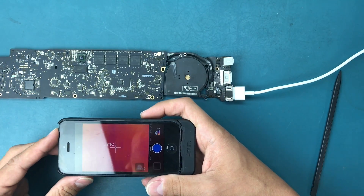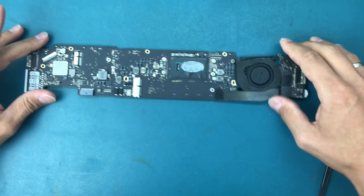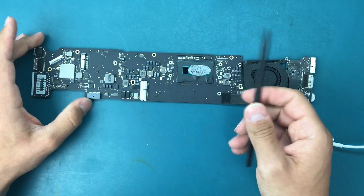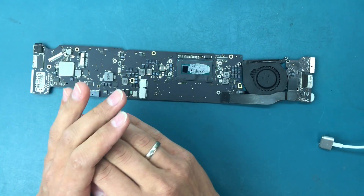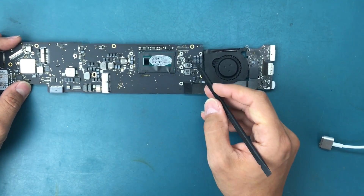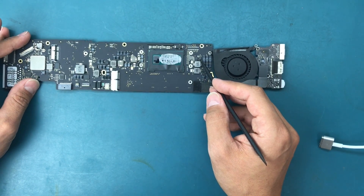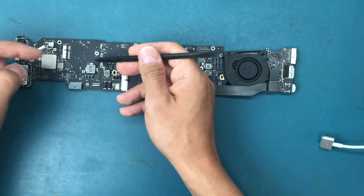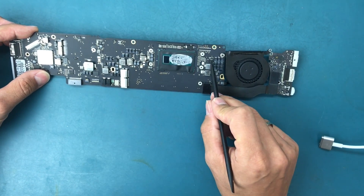There are a few things we want to do now. We haven't done any voltage readings yet, so that's the power of this tool - it basically tells you what's hot. Sometimes when a component is at 200 degrees Fahrenheit, it's definitely shorted. In this case the fuse and that chip aren't that crazy hot, although it still might mean they're burnt. I'd first check the continuity to see if the fuse is still okay or if it's blown.